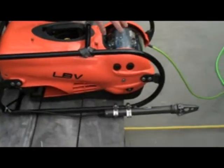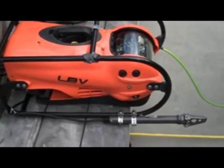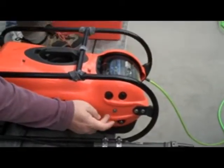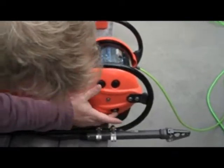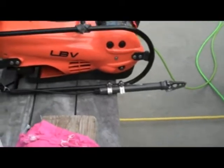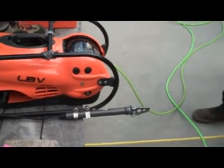Something else you might want to do — this actually has a vacuum pressure. It has a port that you can screw into on the side, right here on the bottom. You hook a hose to it and then you can check the vacuum just to make sure it's sealed, that there's no leaks in there — so do kind of a compression test.